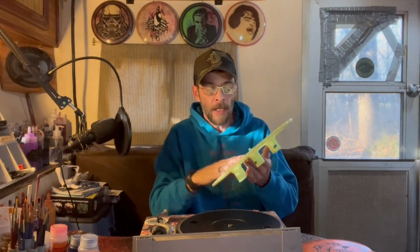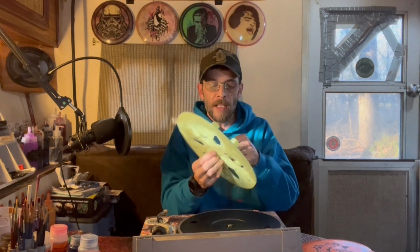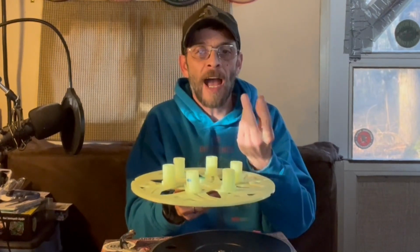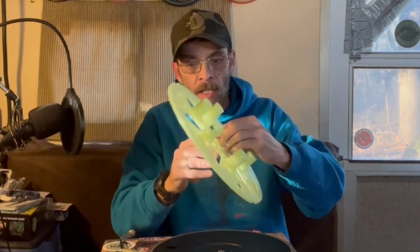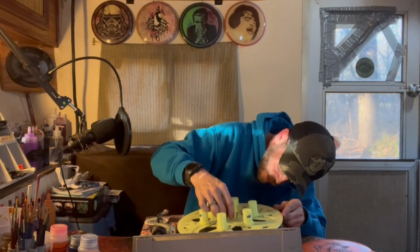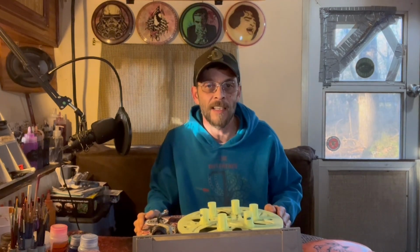And that's when the drywall anchor, screw anchor idea just popped into my head. So I went through a couple of these bad boys before I found one that was the perfect fit going through the hole in the chuck. It was a number 8 drywall anchor. Because these things are designed to push out under pressure, it holds really nice and snug inside the hole of the Clara Chuck. And then the little piece at the bottom, I line up with the hole in the spindle, stick that in there, and it holds nice and tightly in there as well.